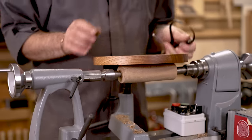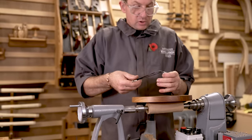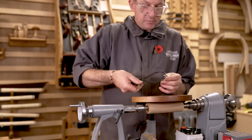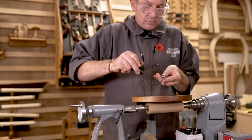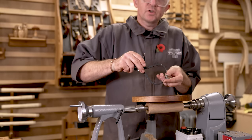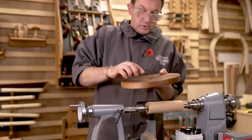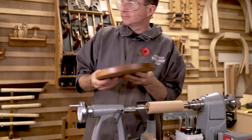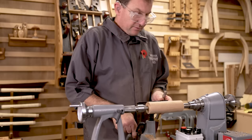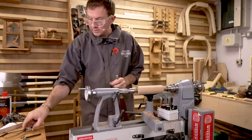So I've just grabbed our disc. We know we've got our 20mm hole in the middle. There's our drill. So we're going to measure this. I'm going to set a calipers up on there. So we turn it round just a little bit more. Oh, that's good. Just clears it. So we've got to match that. I'm also looking at how deep we've got. So we've probably nearly got about 6mm. Again, ring centres are good for this because we've got lots of access around it.